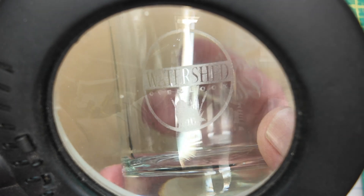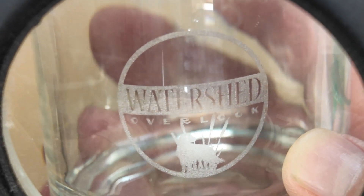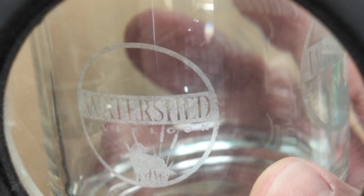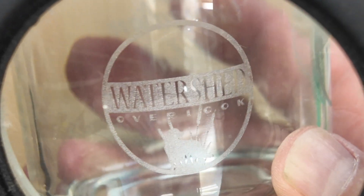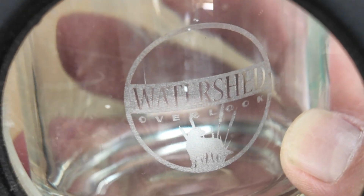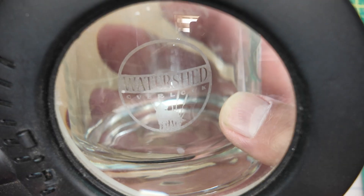Here's the best result I can get using a CO2 laser. It doesn't look terrible, but you can see the inconsistency — or I guess what you might call the fracturing of the glass, so to speak. There's a tiny bit of chipping here on the right side, just two or three spots. And even after sanding it a little bit, you can see lines. And it's not the engraved lines, by the way, because I engraved it the other direction. It's just the result that you get time after time after time. And here's the big difference.